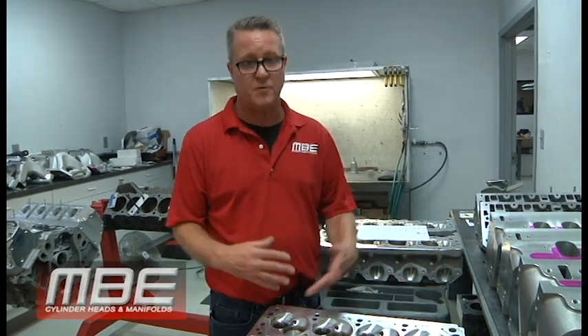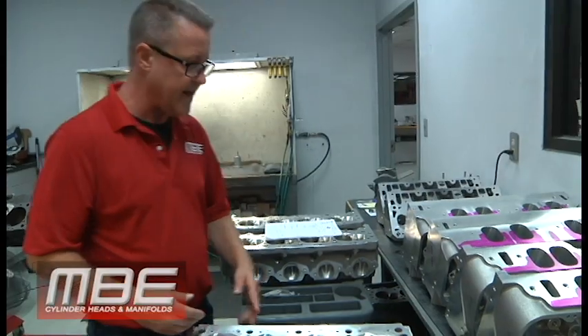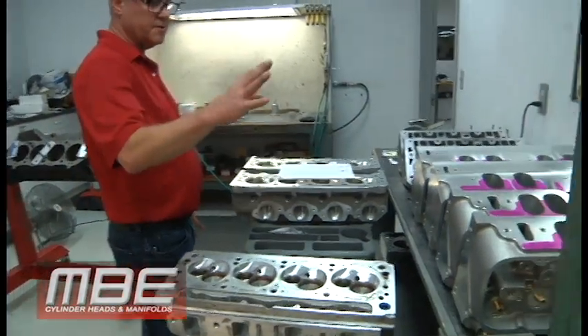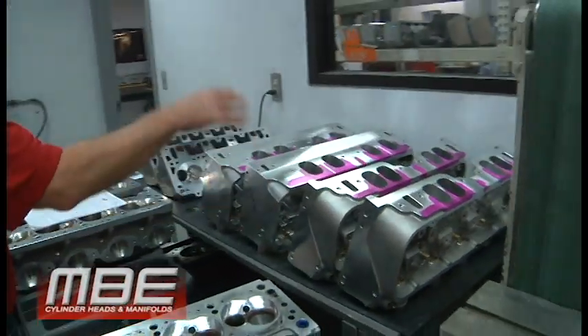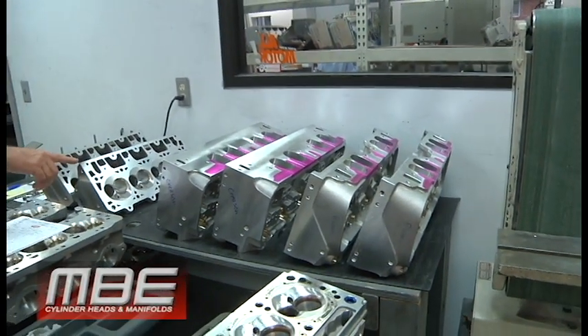This turbocharger is going to make more power because it'll have more exhaust going through it. With that, and just normal stuff — we got the 18s, got the big 9s. So these are finished for Mr. Creason. They've been blended and everything, CC'd and decked. They're just mocking up manifolds now — you can see that right here.